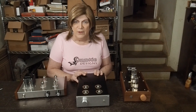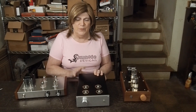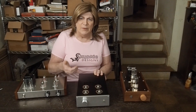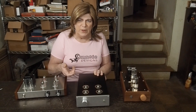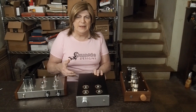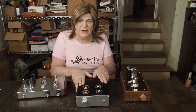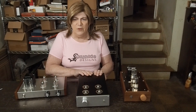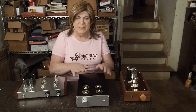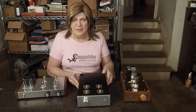Adding a switch means more possibility of the input signal being exposed to noise. I may also go ahead and do the sub out. For the high pass filter going to the tube amp, I'll have to configure it for the load the amp presents, so I may want to wait until I have a specific power amp I know I'll be using. The low pass filter is fairly easy to configure and doesn't depend on what's after it, so it would be straightforward to configure a low pass filter for the sub out.